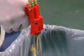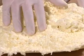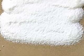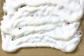If you see more B chemical than A chemical, your foam will be nearly white in color and may have a spongy surface. In extreme cases where no A chemical was dispensed, you'll see a white frothy substance that appears to rise like foam, but will revert to a liquid after a short period of time.